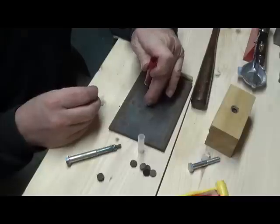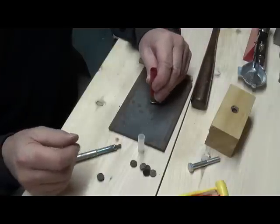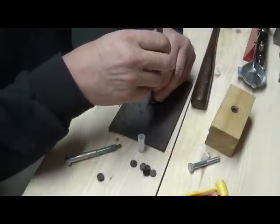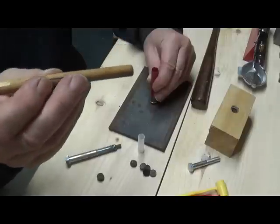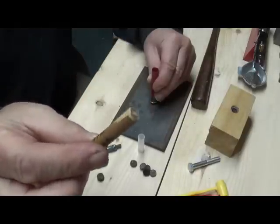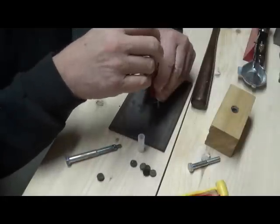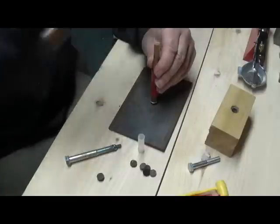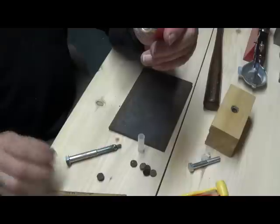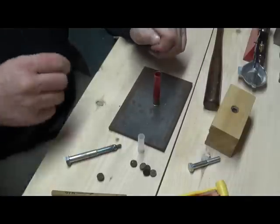Just get it a little wet and your primer is out, ready for the trash. To put the new primer in, I've got a piece of quarter-inch steel — you don't need one quite this big, but I wouldn't go any thinner than quarter inch. Put your shell over your primer, and this is a three-eighths dowel, probably four to four-and-a-half inches long. I chamfered the edge where I pound on it so it won't mushroom out when you hit it.